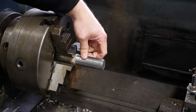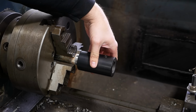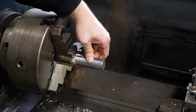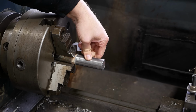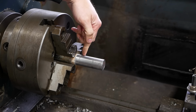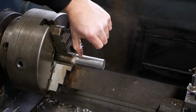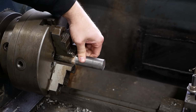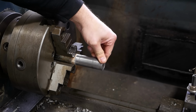This is almost too good. Nice tight fit. Pretty decent surface finish. I mean, for mild steel that's been hand welded with a MIG welder. Little undercut there at the end of the weld. You can't really avoid that. But otherwise, there are no inclusions or imperfections.